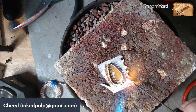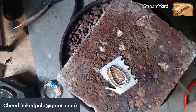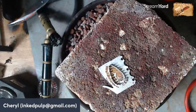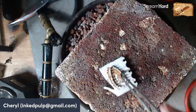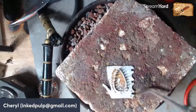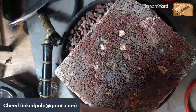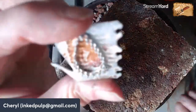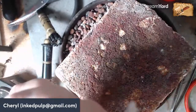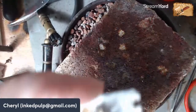There goes the solder! I can move those balls around a little bit with my pick. That's where I usually melt things — I'll be moving those little balls around and forget to watch where my flame is and then it melts. There we go — there's that part of our ring with our little balls on. I'm going to cut that back plate out and go around the balls and up around the bezel.